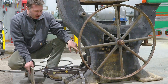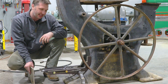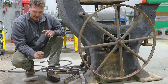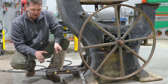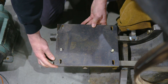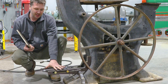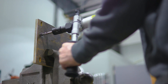Here's a little update on where we're at. We got all the parts cut and finally fitted to this casting — which, my fault, I didn't measure these holes. It's casting, it's all not perfect, but we got it working pretty good. We have some in and out with this sled that can slide on these rails to help tension the belt. This plate by design is matched to the motor, and all you have to do is bolt it down with these two bolts to the slots on top of the sled. The beauty of this is, if this motor were to go bad, all I'd have to do is make a new base plate that matches the new motor and plop any new motor on top. The next step is to tap the holes to go into these slots in the sled and then mount the motor up.